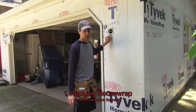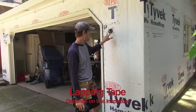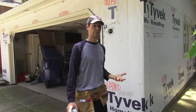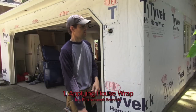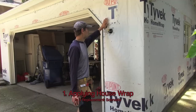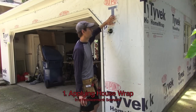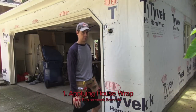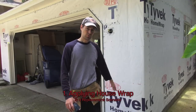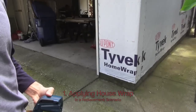You do tape the light fixtures. You should lap it — put a small piece here, then these on top, then these on top. The building inspector said vinyl siding leaks like crazy, so you really want to make sure you do your bottom first and then lap it with the top and overlap. That advice is easy to find. You don't tape the bottom — the bottom of the building does not get taped.